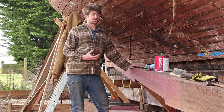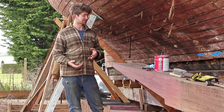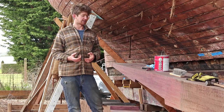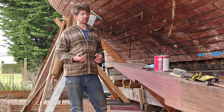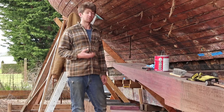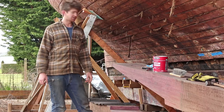So rather than trying to bond the wood together using glue, what we do is bed the joint together with something that stays sticky and soft and doesn't dry out. In that way, as the wood moves later on, it's going to maintain a good watertight seal, which is what we want. And I'm also going to put this roofing felt in, Irish felt.